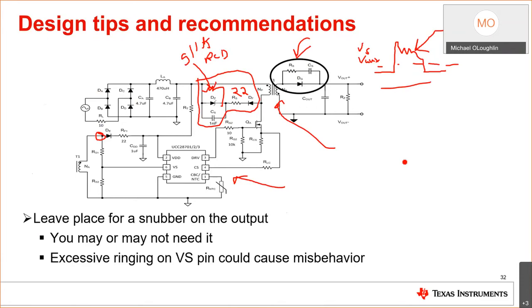You can make your design, you can reduce the noise, be smart about winding your transformer. Machine wound is preferred because once you have your design working, you want your results repeated. If you hand wind your transformers, you can't repeat your results. You just can't. If you're the only person winding the transformer, you might be able to, especially if you're the engineer who designed the transformer. But I don't know about you. I don't design more than three.